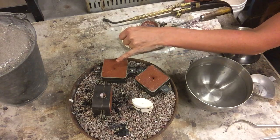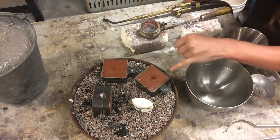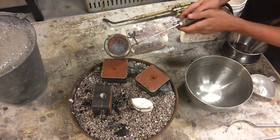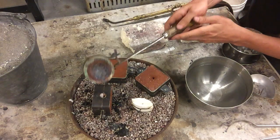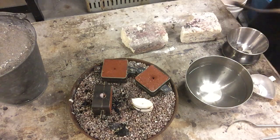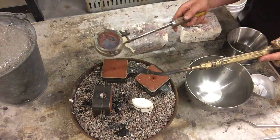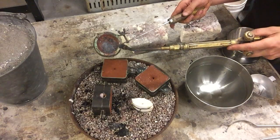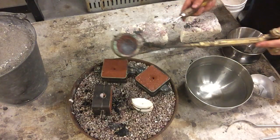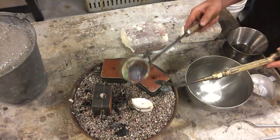We're aiming for each of these four targets. Each time we're going to have our crucible preheated and we're pouring into the mold. I'm going to have the torch in my non-dominant hand and the crucible in my dominant hand so I can aim for that brief moment where I need to get that 1800-degree metal into the mold.